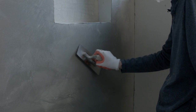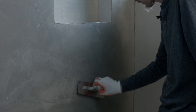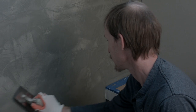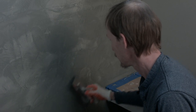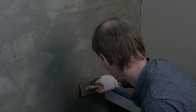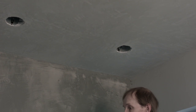That's like the coolest part to me — I need to watch it change color. You can see right now is the perfect time to trowel on it. Just watch it change color as you're running your trowel across the wall. It's not pulling any mud and it's not too dried out. The timing is really critical to get the look right. Right now there's still a lot of moisture in it and so it really pronounces the texture — you're not going to see this when it dries out.